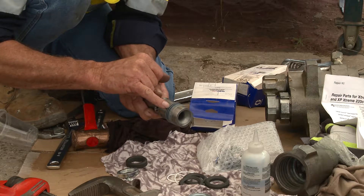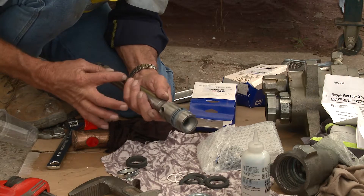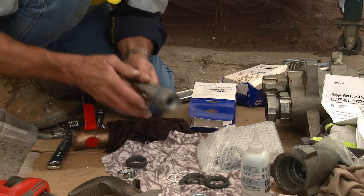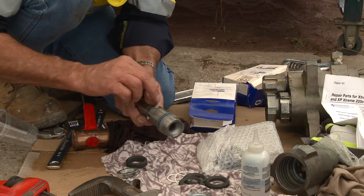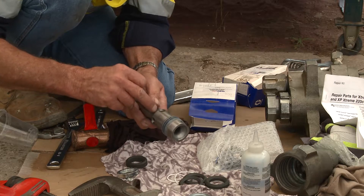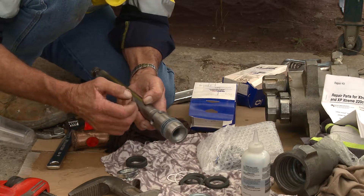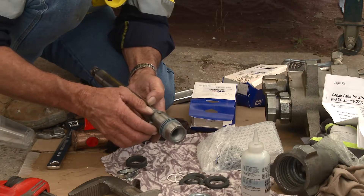On the bottom of the piston you have the second set of rack of packers. So top packings, bottom packings, and inside that's your secondary ball — a secondary ball valve which seals on the pressure side before delivering out the airless paint line.